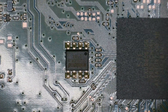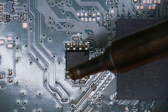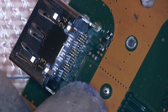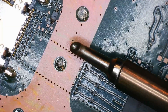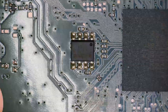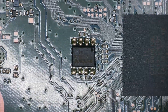This gives me a good opportunity to showcase a new tip for my Hakko soldering station, recommended by Wayne from GetRefurbed. It's a T15 BCM2. I was having a struggle tinning HDMI ports on the actual pins themselves, and I'm hoping this is going to change that. It has a hole at the end of the tip where solder sits in — that in itself is pretty cool. I'm going to add some leaded solder to these chips because sometimes they can really struggle to come off the board.